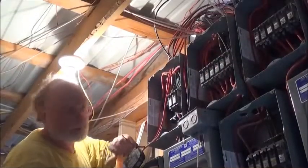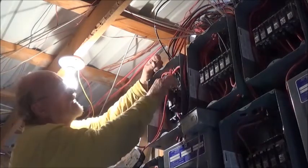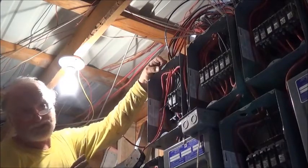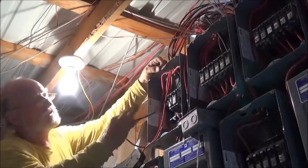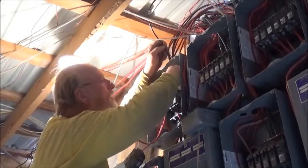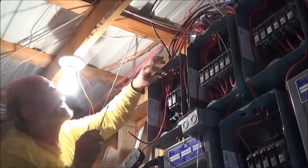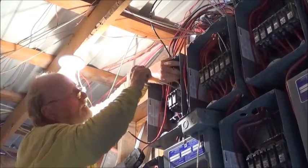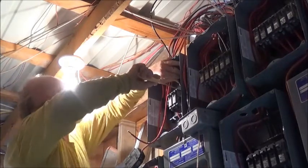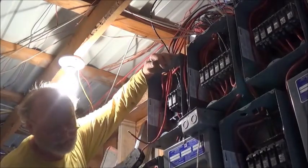If you're in the power room on the fuse panels, we're about to wire that one panel we're working on into the box. Leave the wire on the spool, don't cut it, run it all the way through so you can have extra — like I have here with the red and the black. The black goes to the top of this normal electric box I'm using as a combiner. This one is going to take five panels and combine them into one wire that comes out the bottom, and this red wire is a combined wire that drops down to the charge controller.